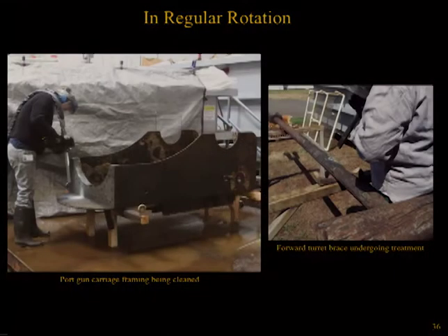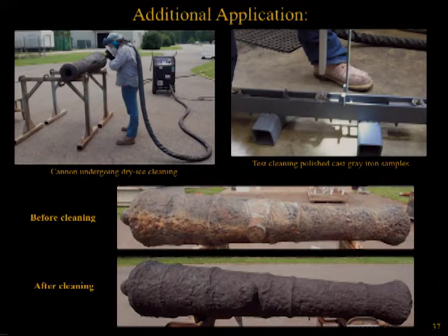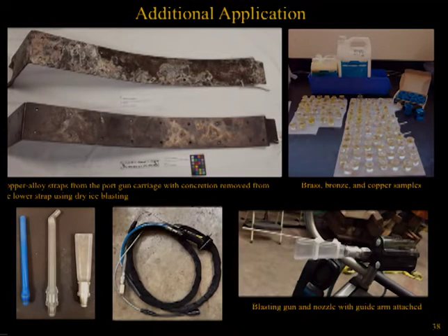Since April of 2016, the Conservation Department has carried out dry ice cleaning campaigns on 492 wrought iron artifacts, with the goal of conducting a major cleaning effort on USS Monitor's turret during the summer of 2018. The Maritime Heritage Grant also enabled the museum to bring on assistant conservator Lori King, now a permanent staff member, to expand the dry ice cleaning research into corrosion and paint removal on cast iron and copper alloys. Using the same testing procedure developed for wrought iron, she successfully identified safe cleaning parameters for these materials, though this required a different nozzle, gun, hose, air volume, and shaved block instead of shaved pellets. Presently, she's continuing to refine this research.